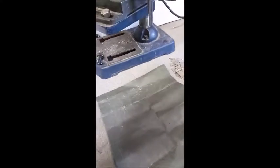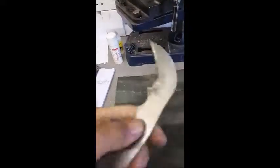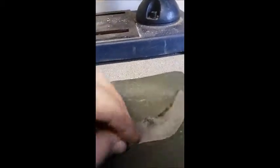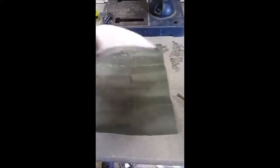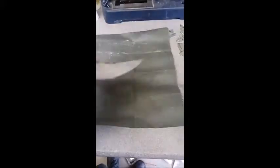It's quite easy. Because this is stainless steel, it's a lot harder than mild steel — the industrial heat treat is much better just because of how much more expensive this is. All I'm going to do is grip the knife in one hand, grip the wet and dry paper with the other, and move it in circles. Moving in circles takes off that surface — the chromium finish. But because this is stainless steel, chromium runs through it which makes it stainless, so this shouldn't really affect the corrosive resistiveness. I'll just do that for about 10 minutes and show you the results.